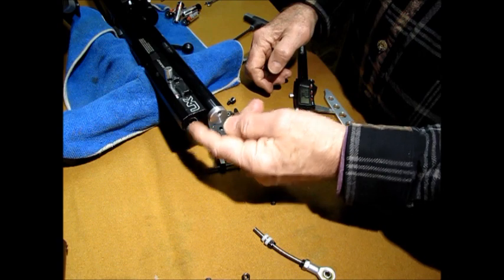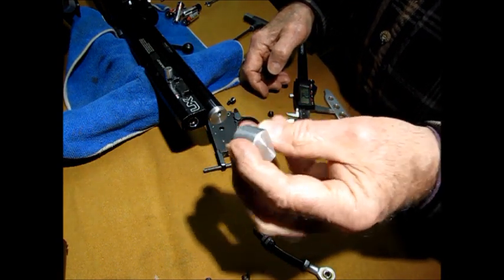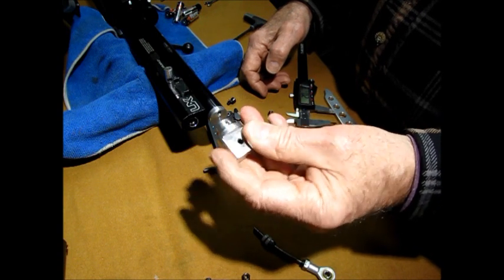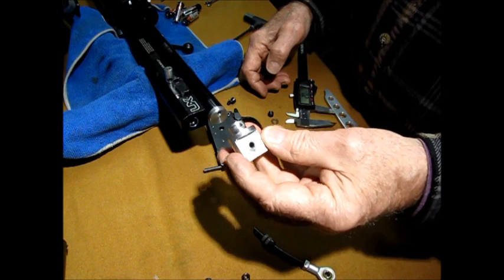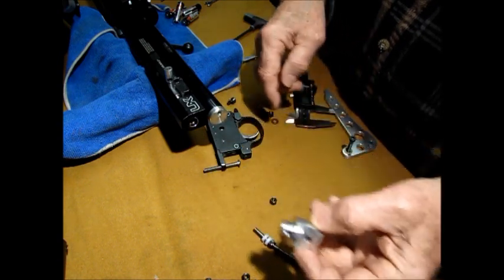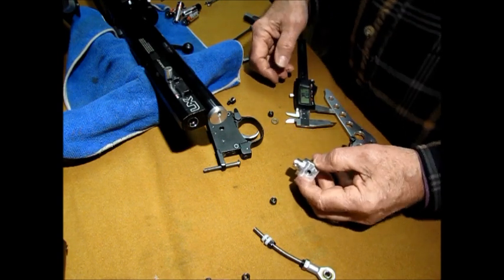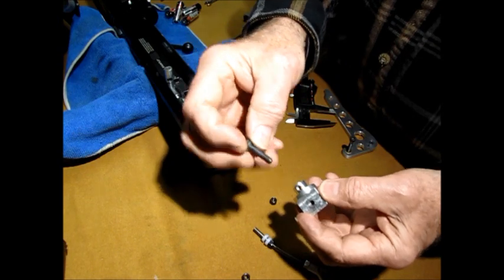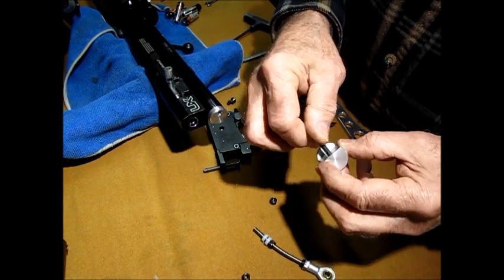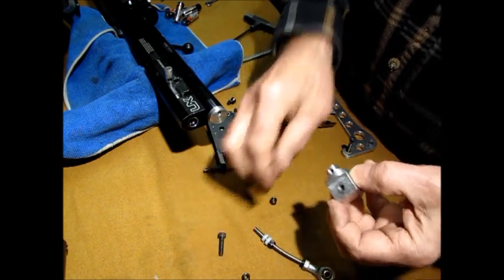The spring is in. Now the second part of this is you need to build this little bolt in the back, or pod, or pivot point. I guess it's a pivot point. Anyway, this has to be drilled and tapped, 5 millimeter. It has to fit the bolt. 5 millimeter bolt, which is that one right there. These are just cap screws, okay? 5 millimeter. Just goes in there like that, okay? And I'll show you in a sec here how that goes.